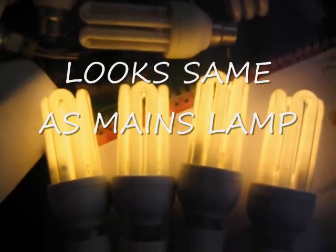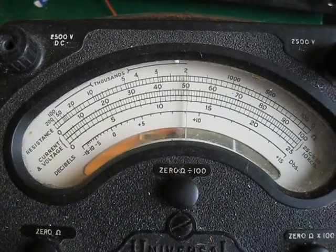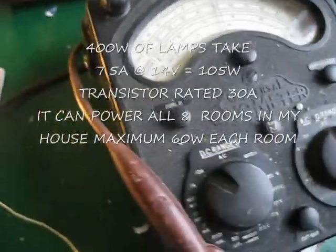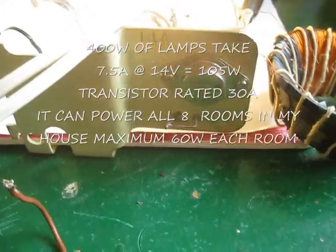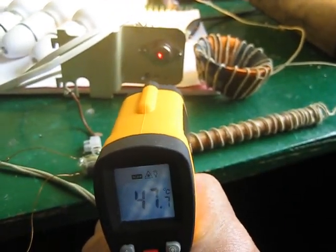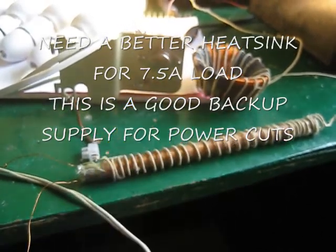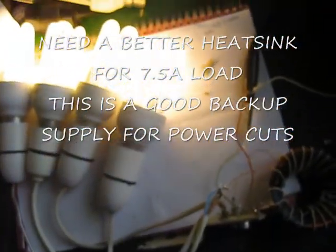It does take just over 5 amps with three 100-watt Philips lamps and the transistor gets to about 65 degrees centigrade. It's probably not very warm right now — just plugged it in, 47 degrees at the moment — but it's only a small heatsink. Any ideas how to get rid of that squealing noise?